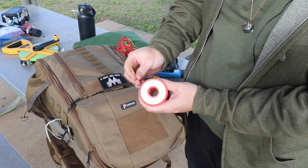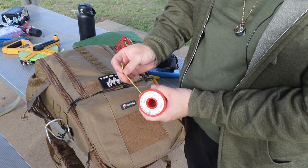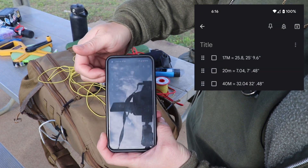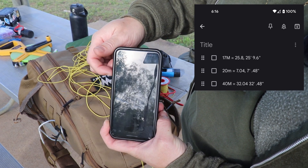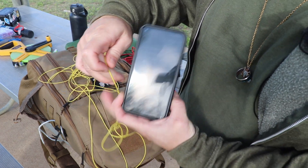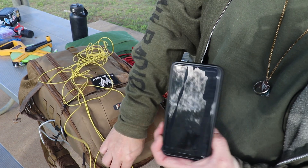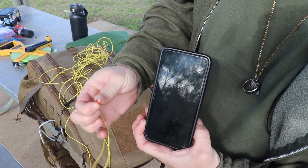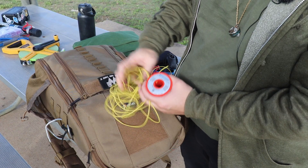I've got the Belden Techno wire — this is a beautiful, very flexible 20-gauge wire I'm making my antenna out of. I already have all the measurements pre-cut: three sections — a 17-meter section, a 20-meter extension, and a 40-meter extension. I already pre-cut one section and crimped a ring on it, so we're going to put that on the tape measure and see if it's right.